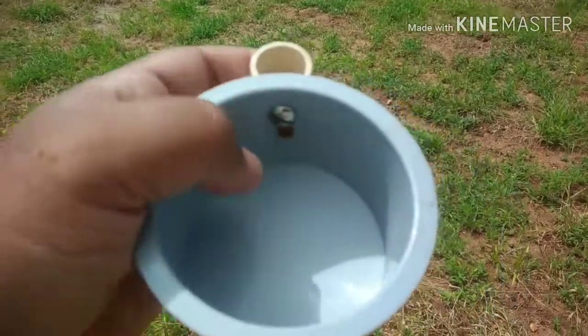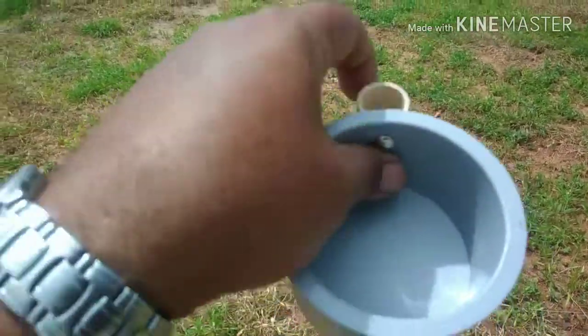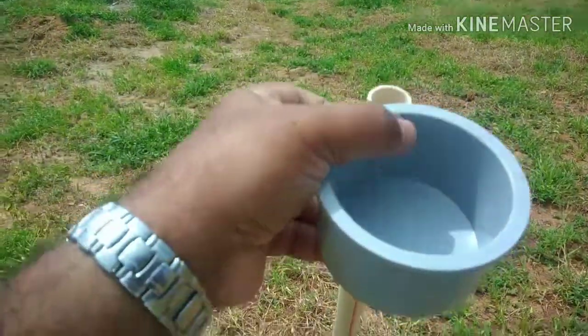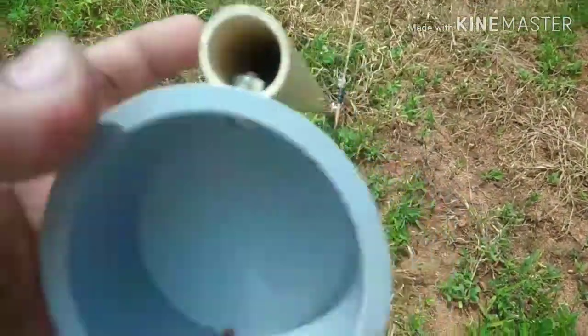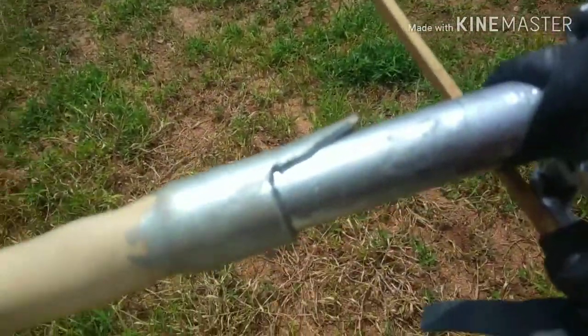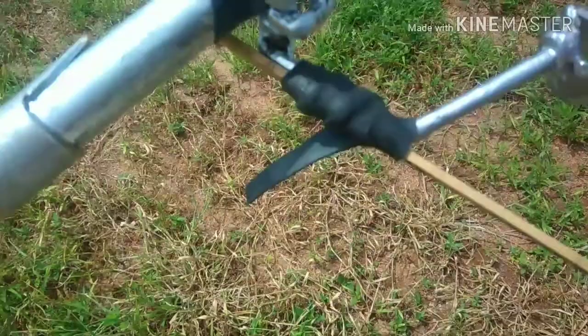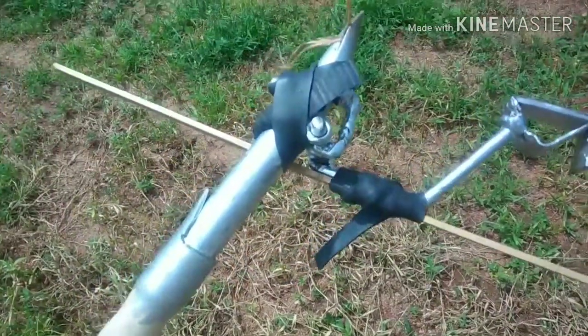Here is the final version of the manual seeder. I kept a 4-inch end cap dummy of PVC pipe and drilled a bolt here in a slanting position so that the seed can be dropped in. This is screwed down with a nut and bolt. For the other end I did a small modification wherein the loose lip is made a bit larger than the fixed lip. For visibility I have put one rubber tube over here, and for measuring the gap distance between two seeds I put a small piece of stick tied to one end.